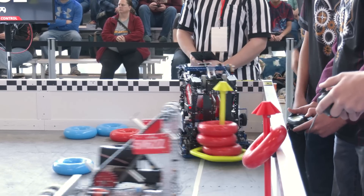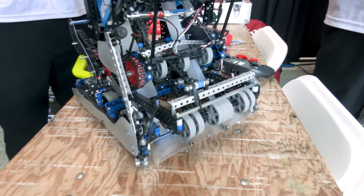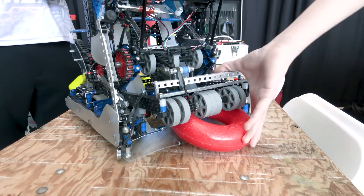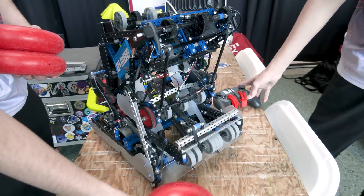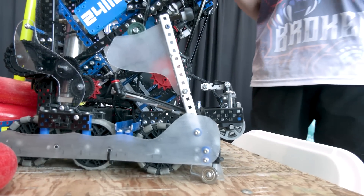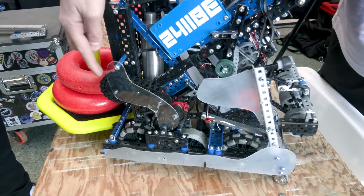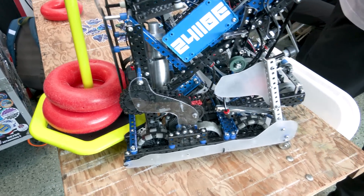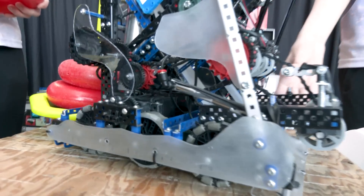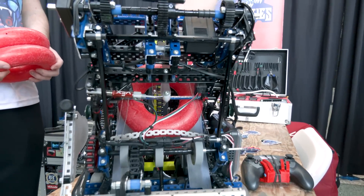Ty, let's start with the intake. Over the course of the season we've always had a hood-slash-hook combo, and we kept a similar design here with two sets of flex wheels. This one moves at 800 RPM and this one at 400 RPM, which gives us a smooth transition up the intake ramp and into the hook stage. We have a chain tensioner — we had problems with the chain falling off so we added that. We use one-and-a-half motors: a 5.5-watt and an 11-watt inside the robot. The gearing is multiplied by three to get equal RPM on the intake, so this stage runs at 600 RPM, then a 75% reduction brings it to 400 and 800 respectively. We also have plastic strips that stop the ring at the perfect time so the hooks can grab it and place it on the goal.